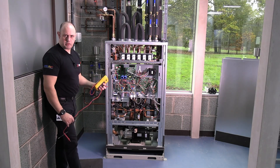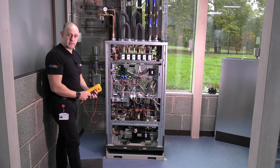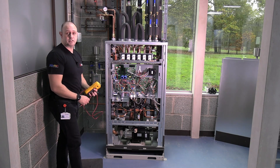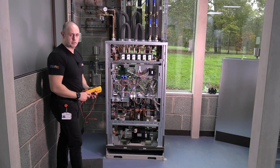Commissioning on the vertical BC box. The first thing I'm going to check is to make sure the power coming in is correct, and that the communications voltage between the outdoor unit and this vertical BC box is also correct. We'll start off with the power.